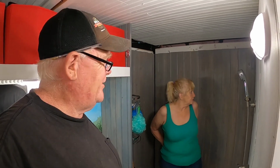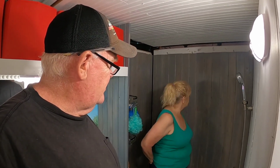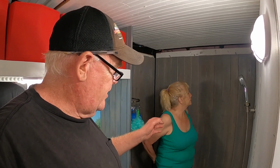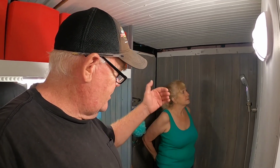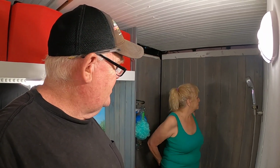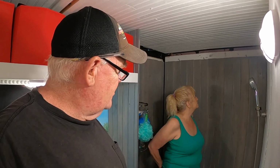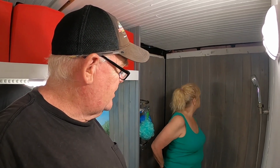All righty. How many coats of polyacrylic do we have on there now? Three coats so far. I'd like to put two more. Yeah, at least two more. The first coat, it really soaked it up, which is a good thing because it's embedded, it's impregnated into the material, which I like that idea. But the more coats you put on, the less it soaked up in there. And that's what we're after, a really good surface coat.